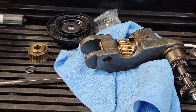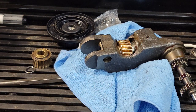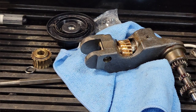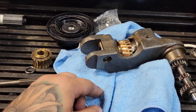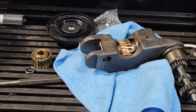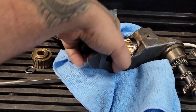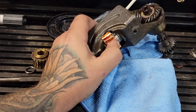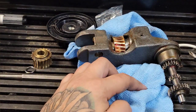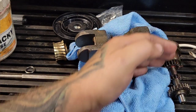It was a good fit - the key was the same, the diameter inside was the same, the gear teeth are the same. This one did have grease on everything, probably because there was a grease zerk in the head. But it's actually an oil zerk - this is supposed to have, on a Bridgeport I believe, just spindle oil, which would be like a Velocite number one maybe. The manufacturer on this machine calls for Vactra number two oil. So that's what we put in it. I did put a little assembly lube on it. I think these will get a little bit of red and tacky number two grease because nothing really oils those.